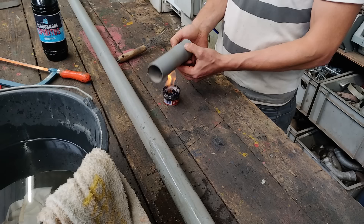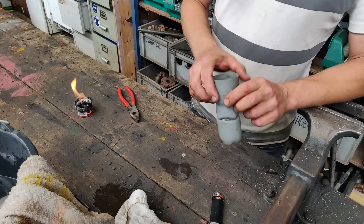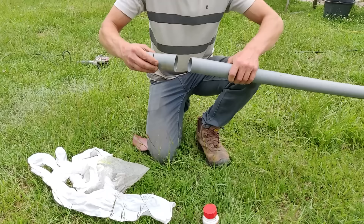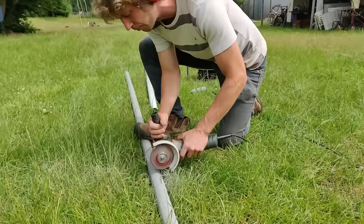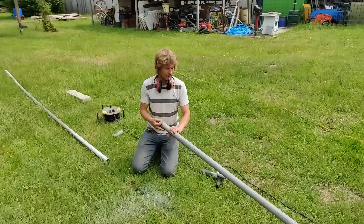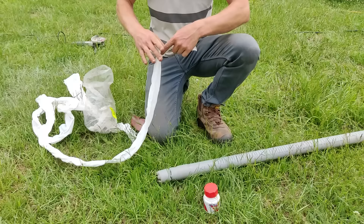To seal the bottom of the well we close this part which will be the end cap — one to five centimeters — we twist it, push it together, and put it in water. The ends of the end cap are folded slightly inward so the pipe centralizes itself more easily in the hole. We make multiple slots in the PVC pipe — you can do this with a hacksaw, but you can also use an angle grinder.